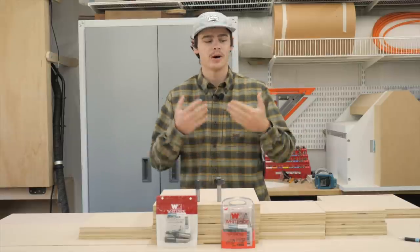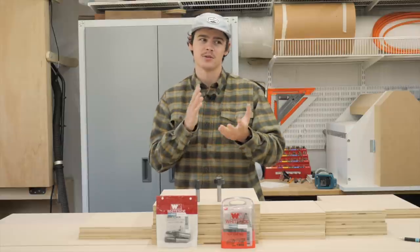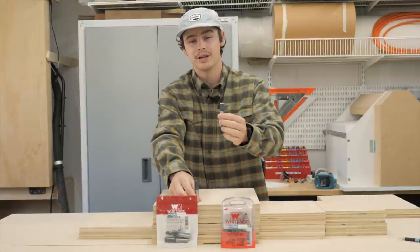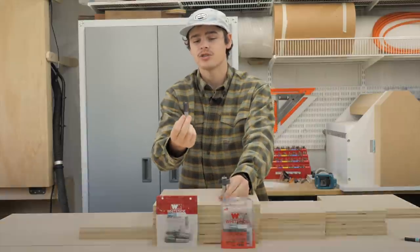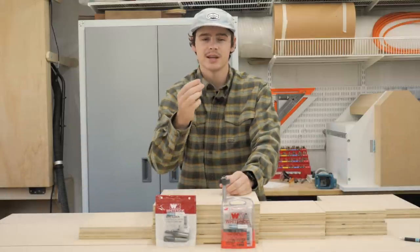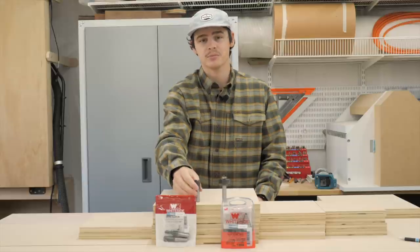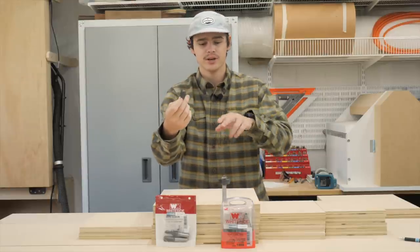I also marked the edges about where the joinery needs to be cut, because one of the easiest things to mess up is accidentally not mirroring parts correctly — getting the wrong sides on the wrong parts or cutting the joinery backwards. Speaking of joinery, we have two bits that are basically going to build this entire bed. This first bit is a rabbiting bit set from White Side Bits with the Astra coating from Bits and Bits. The other is an undersized three-quarter inch plywood dado, slightly under three-quarters of an inch so it matches the true thickness of three-quarter inch plywood. That Astra coating really helps extend the life of these bits — a great value. We have a coupon code and links in the description below.